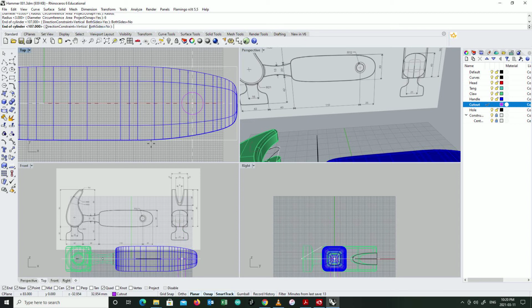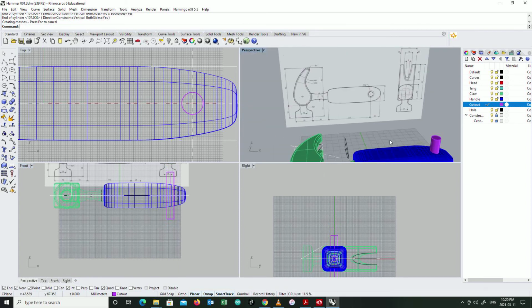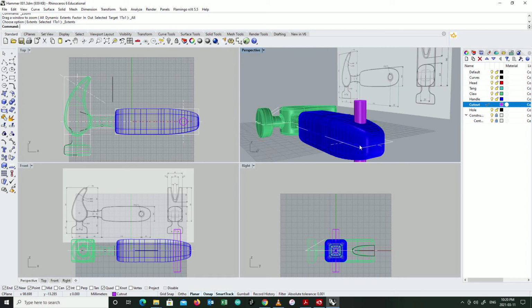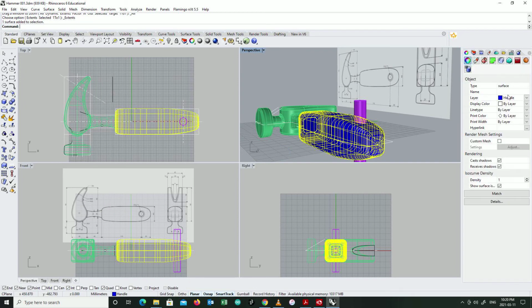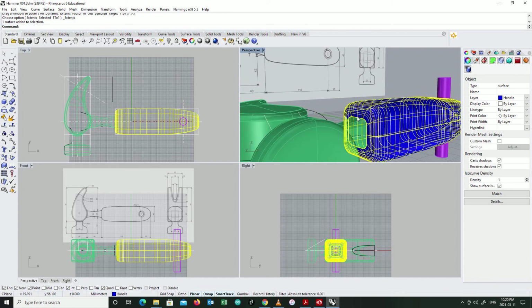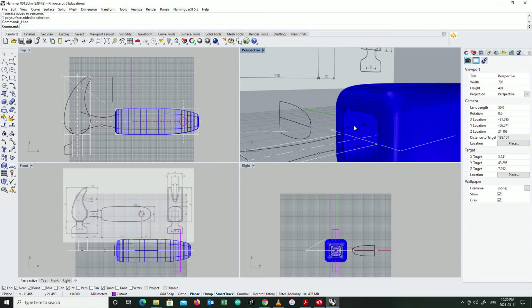I'm going to do both sides. Yes. Drag my cylinder out. Let's refresh my views here. Okay. Solid. Oh, actually, first of all, this is a surface. And again, I can see if I take a look at my object, it's a surface. And the reason it's a surface is because when I did that sweep 2 rails, this was open at the top. And if I hide the top here, you can see, yep, that's a surface.